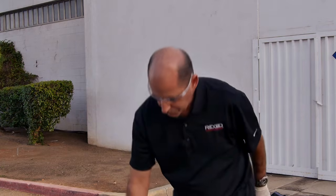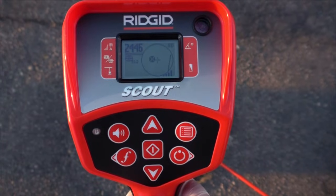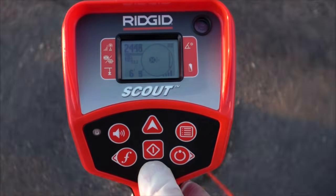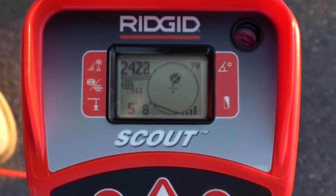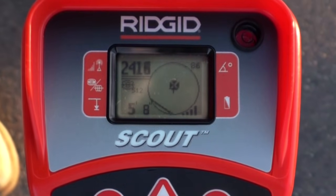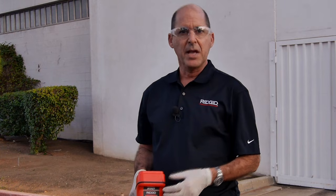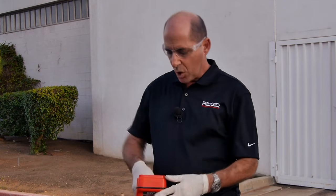This tells us the sonde is tilted, and we'll need to pinpoint its position by finding the point where the signal is strongest. When we find the place where the signal is highest, that's where we'll mark the sonde. When a sonde is tilted, Scout's automatic depth feature won't work, so we'll need to use the force depth feature to get a reading. We'll position the receiver where the signal is highest and press and hold the down arrow key. If the depth looks reasonable, we'll rotate the receiver 180 degrees and take another reading. We're looking for the two readings to be within about 10% of one another. If there's more than a 10% variance, we'll want to rotate the receiver about a quarter turn and take another set of readings.